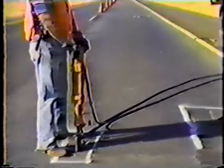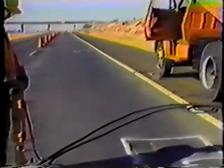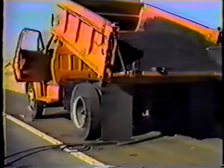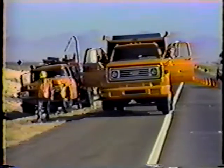Here's how the hand tools work. The tool connects to the truck with two hoses. There's a switch on the truck to divert the flow of the hydraulic fluid into the hoses. The pressure of the fluid circulating through the hoses then provides the power for the tool.